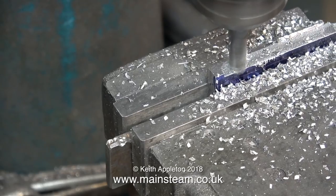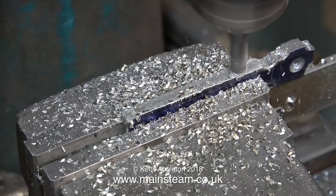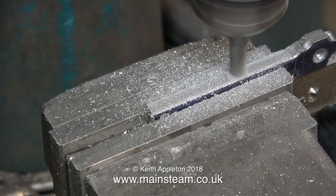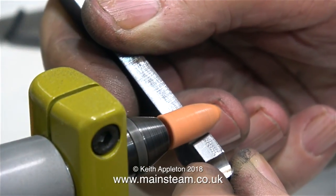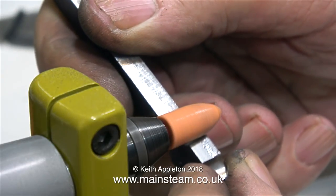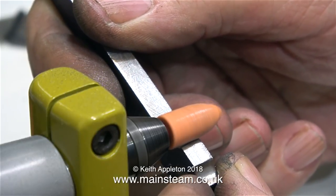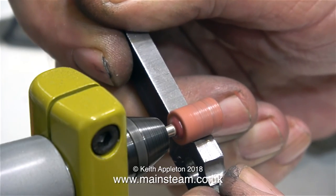And don't forget it needs to taper. This component is going to remain looking very crude until I finally finish it. I'm able to take much deeper cuts with the end of the end mill, but I'm making sure that I position the cutter exactly on the centre line of the work. At this point I remove the part from the milling vice to clean off the burrs created by the end mill. With my Proxxon motor tool fitted into the holder, I can use this to further clean up the milled parts. The finish isn't bad from the milling cutter, but it's going to look a whole lot better after the Proxxon motor tool's done its work.